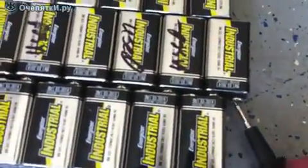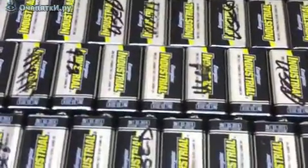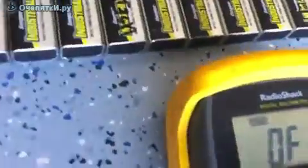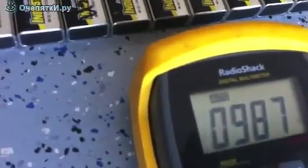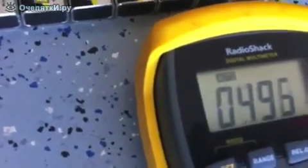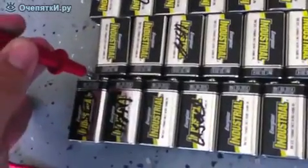Now, I'm going to measure the other ones, which are these guys right here. So I'm going to do this. Put that on there. Probably should get my alligator clips, but that'll be just fine to sit in there. And then I'm going to measure down in this end on the positive. Too much. This meter only goes up to 1,000 volts. So that's 987. That's 994. Right there. So I have 994 here.